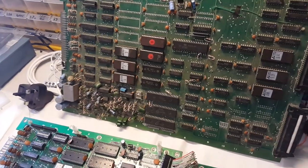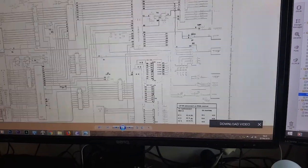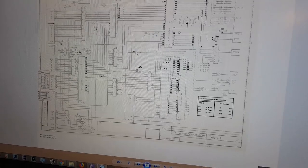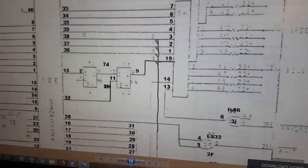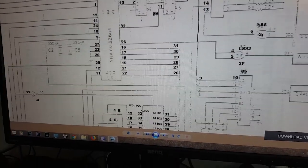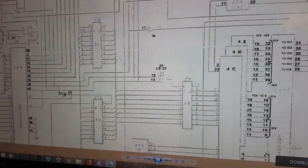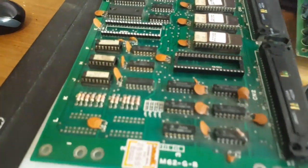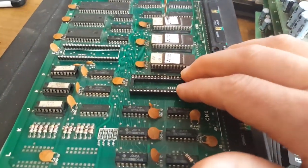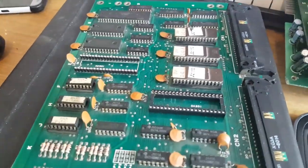Let's go to the computer and look at the schematics. I've got the schematics page for the top board here. There are a few degrees of difficulty because a lot of the text is faded, so I had to do a lot of double-checking and rewriting just for clarity. The first step is to double-check each IC against the schematic — in this case using the sub-board as a reference to confirm it matches.